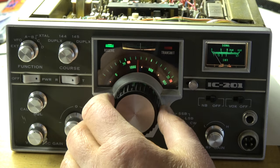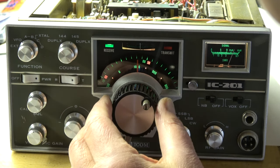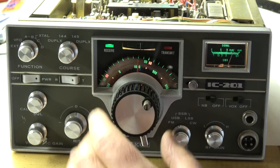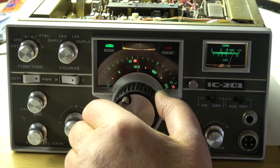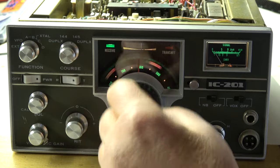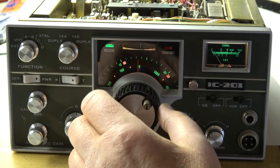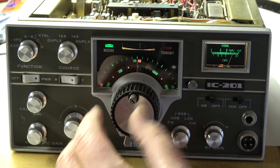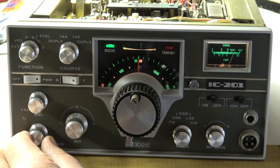When it comes to zero here - okay, we have one kilohertz more. The green scale, the upper scale, is one kilohertz per division. There are some birdies - ignore them. Roughly two kilohertz. This is the lever for fine tuning. Fast tuning - okay, the linearity is rather good. An error of one or two kilohertz over the whole range is acceptable. It can be adjusted in the PTO but I don't do it at the moment.